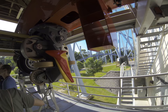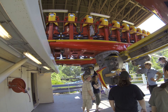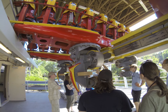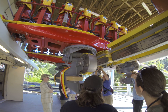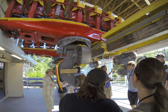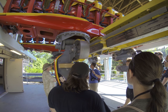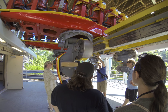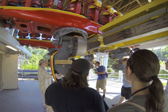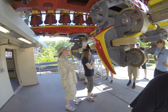Everyone who went up to the top — right here — this is that special turquoise bump that I was talking about. It's locked right here. That'll be up when it's going through the lift hill, as to not interfere with the lift chain dog right here. That green bump will bump the switch, the chain dog will come down, and then it'll lock into that distant chain that we talked about.